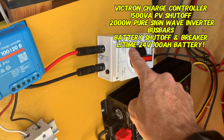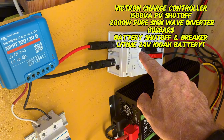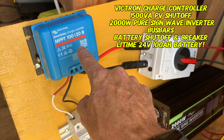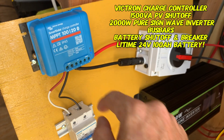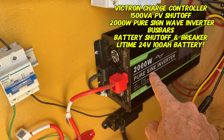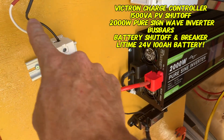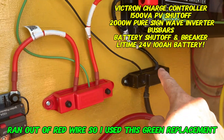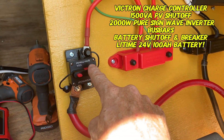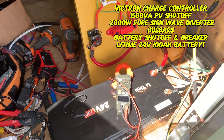It's connected to a thousand watts of panels from the solar shed roof, hooked up in two series, two parallel at 250 watts each. However, this charger can only charge at 24 volts, 20 amps — about 550 watts. We changed the inverter from the 1,000-watt 12-volt inverter to a 2,000-watt pure sine wave inverter from the solar shed. We also updated the wires and bus bars, running through an on/off 100-amp breaker switch.